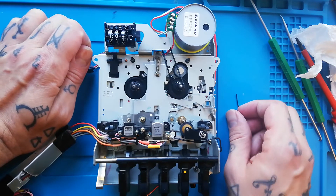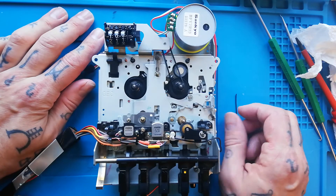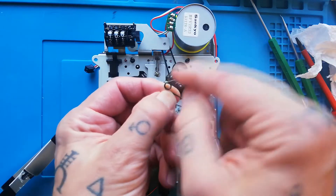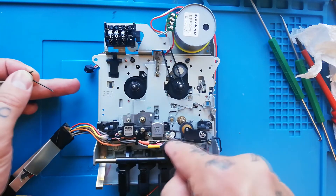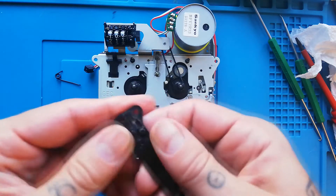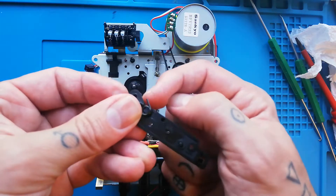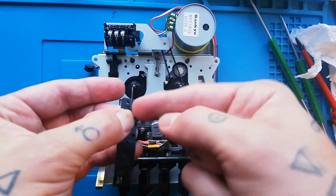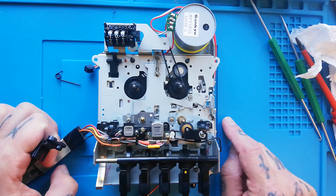The solution to that — which isn't my innovation, it's been demonstrated very well by another YouTuber focusing on Portastudio repair called Third Island — is to remove this and reshape it such that you unwind the shorter arm and the newly lengthened arm gets shaped to go into the recess. Here's the head base removed; you can see I've actually glued this one, but there's usually a break where the spring arm is meant to go, broken off altogether or snapped. Once you unwind it you get both legs to go through the recess. I'll put Third Island's video link into the description.